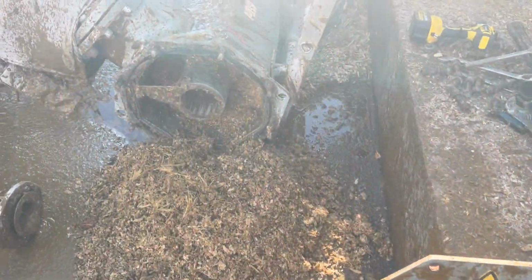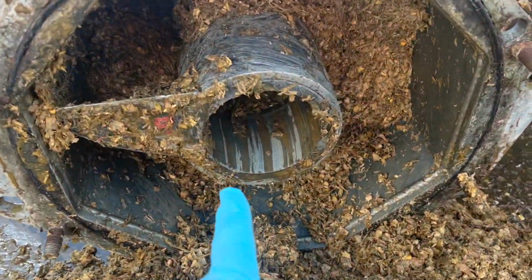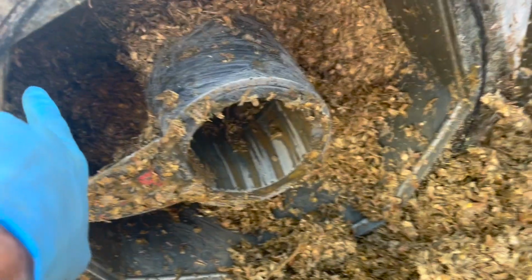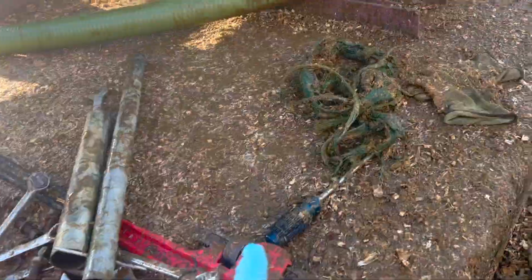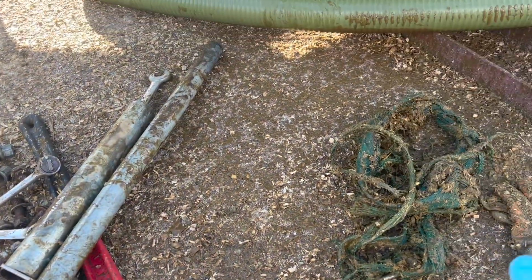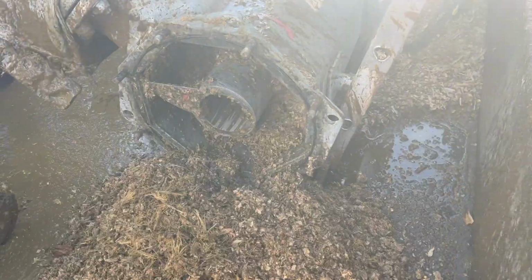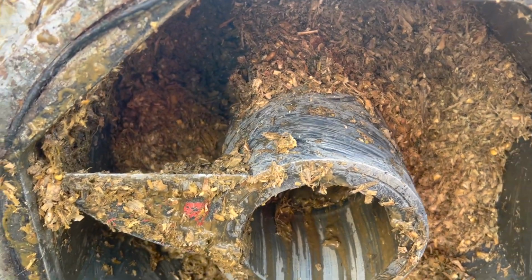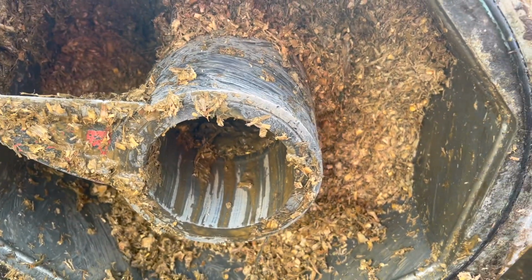That's the front plate off, guys. Here we are. This is where the liquid goes into. It then rotates up and squirts up through here into the rest of that, and that was clogged with the gravel bag, so that's why we're getting overpressure, because it can't get through the gravel bag and it's blocking up. We're now going to try and run it. There's a bit more on the side there. There's something horrid down there, plastic. I can't dig much more out, so we're going to try and run it.